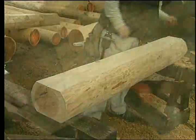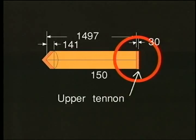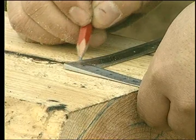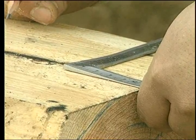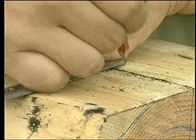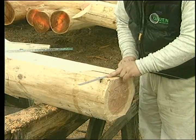Now we will square a line around the log. This line will be at the top end of the brace and need only be a short way onto the log. The final tenon will be only 30 millimeters long, but we have set out about 60 millimeters to make it easier to cut. Place a mark about 60 millimeters from the top end and square this across the log. Do this both ways from the center. Use a sharp pencil to get a thin line.